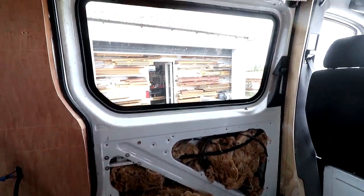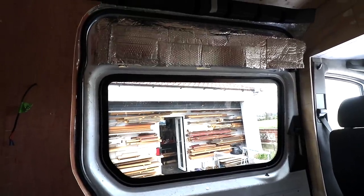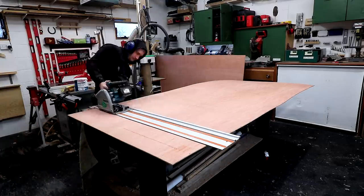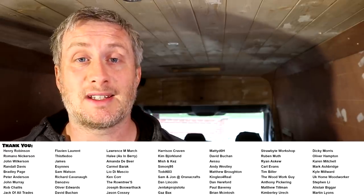We still haven't cladded the large side door yet but we're going to leave that for now until we've decided how to do it. My preference is to do it in two panels — a top and a bottom with no window box — but the client is leaning towards the whole door being cladded, which presents challenges because it's a big door. We'd need to find a way to join two pieces of plywood together, hiding the join as best we can, and also get the tongue and groove grooves cut into the panels to line up by eye with the panels next to them. Either way it's going to be interesting. In the next episode we're going to be working on making the upper cabinets.